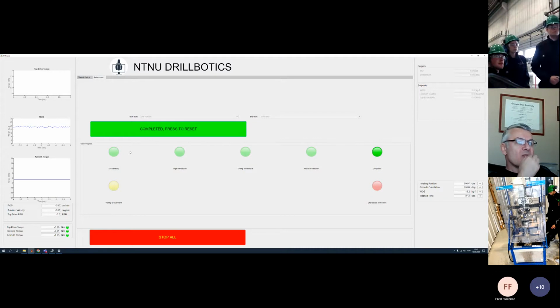Go ahead, Eric. Yes, first of all, really congratulations. That was a very impressive demonstration. But I'm just wondering about the management of the bend orientation. Do you consider that as an azimuth or as a tool face? Because at the end, when you were too high on the inclination, I would have almost expected that it would have turned 180 degrees to try to drop back to the right inclination. Do you have any comment on why the algorithm didn't pick up that possibility and continue to keep the azimuth or the orientation of the bend in the same direction?